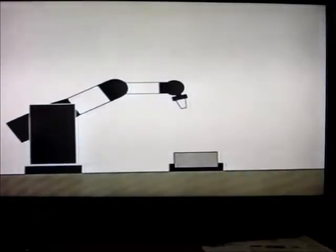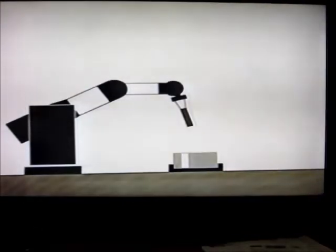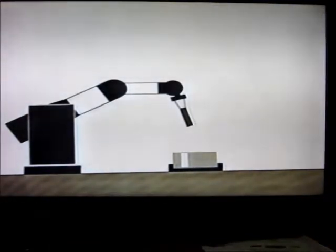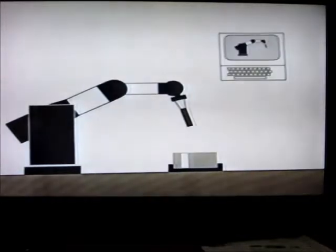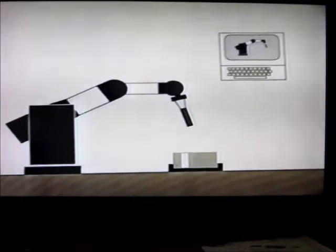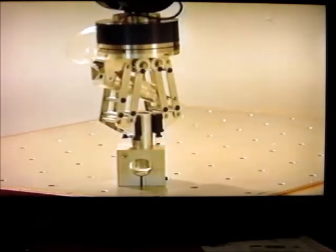the position of the part in the fixture, the position of the hole in the part, and the position of the shaft in the gripper must all be accurate enough so that the cumulative error is less than 1/1000th of an inch. If a CAD system is used to program the robot, the CAD model must also be this accurate. The engineering required to achieve this precision is expensive at best and sometimes altogether impossible. The ability to control forces offers a totally new approach to robotic assembly.